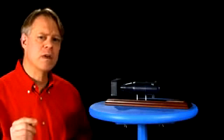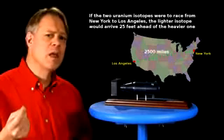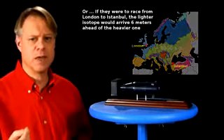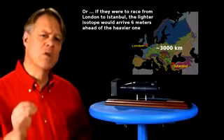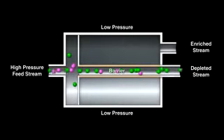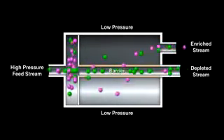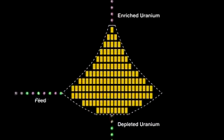That tiny weight difference means the two isotopes will move at slightly different speeds when exposed to an equal force. To enrich uranium for the first atomic bomb, engineers built immense gaseous diffusion plants that capitalized on these differing speeds. A gas containing uranium flows through miles of piping in a kind of race where the lighter U-235 wins out. The gas flows through a tube encased in a chamber, and a pressure difference causes more of the U-235 to pass through perforations in the tube's wall. To increase the separation, the slightly enriched stream passes through many more stages — enriching 3% U-235 to 90% takes nearly 4,000 stages.